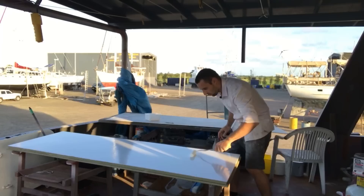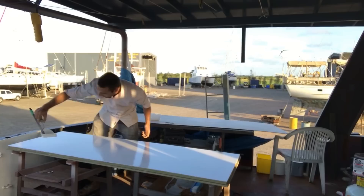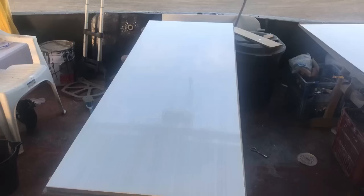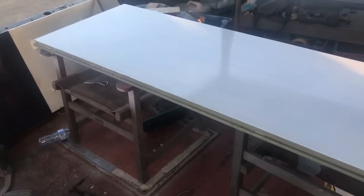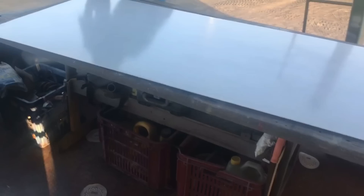I only ever do that on stuff that I really want to get a great finish on. If I'm just trying to cover something up I just smash it on, but in this case I want a really lovely finish. These are our two painted panels - it's quite windy. That's a roller finish using a fluffy roller, so where I roll it you can see there's like an orange peel type surface. But when I push the roller with next to no weight on it, it won't spin and then you get a really beautiful finish. I'll sand this back with 240 and it should come up pretty awesome. A couple of days and these will be on the wall.